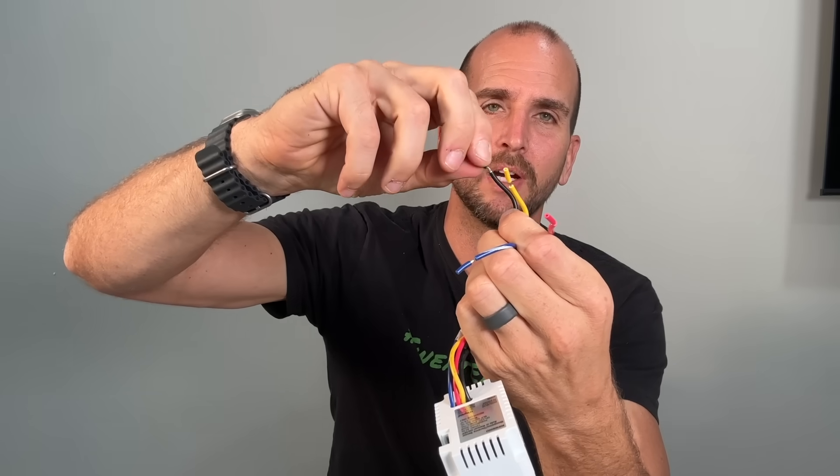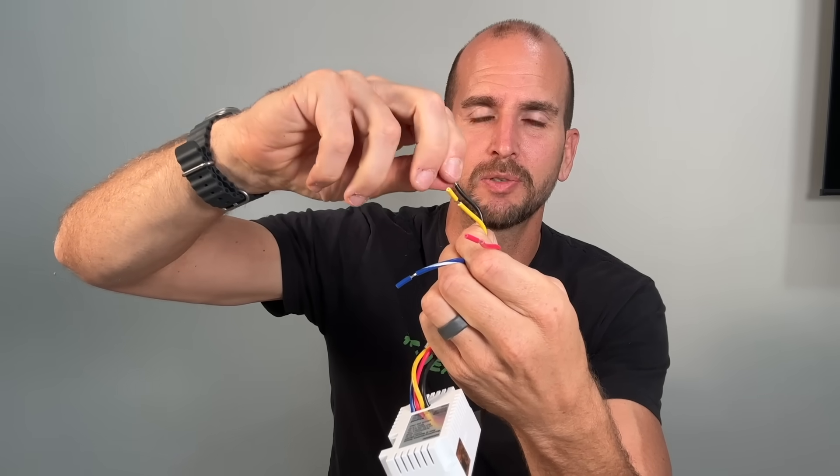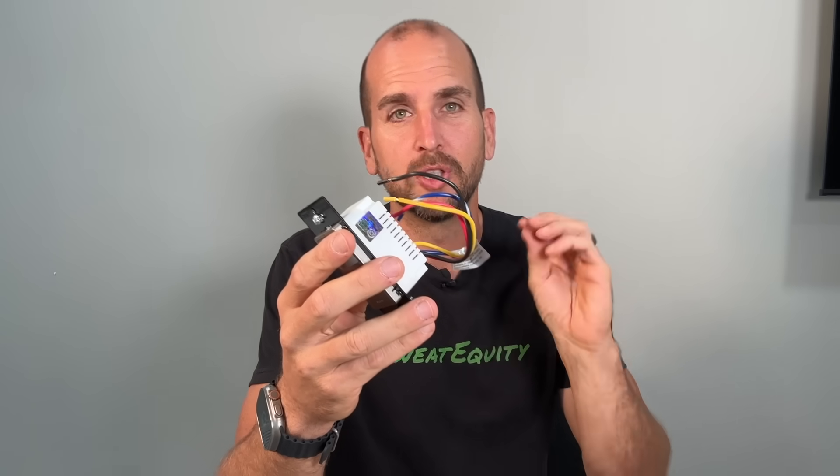As mentioned, it's nice to use that insulation before you take it out and start wiring. Some manufacturers are nice enough to leave insulation on so you can twist those strands together, making a nice compact package and avoiding fraying. You'll find that a lot of devices come with insulation stripped, but you can still use what remains to pull all the strands together.